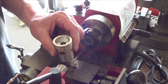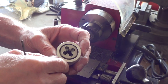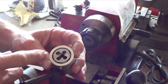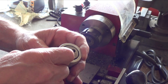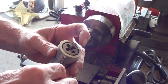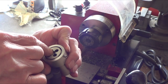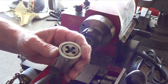Doing some experimenting — if you guys build one of these, it just needs a lot of force and it holds it absolutely square. You cannot move it. Changed out from the thumb knob I had to a set screw. And make sure you're absolutely — because it's octagonal — make sure you're hitting the flat surface before you tighten the screw down.